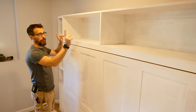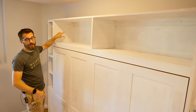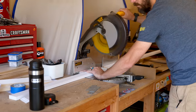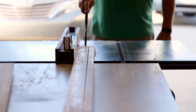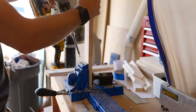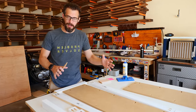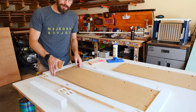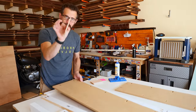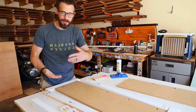The last thing to make here is a couple of doors to put up here, and these are going to be mounted from the top with some hinges — you'll lift them up this way and they'll be held in place with some gas struts on the side. This is one of the many ways to make a really simple shaker style door. We've got a frame that's going to be pocket-held together out of three-quarter inch material, and then there's a half-inch panel with pocket holes in it as well. To get this inset a little bit we've got some spacers — we're going to put spacers underneath this panel to lift it back into the frame a little bit, put in all these screws and you're good to go.